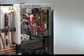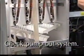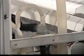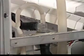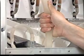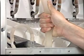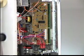Next, let's make sure the ice maker is purging properly by checking the pump-out system. After 5 minutes in the freeze cycle, unplug the float switch to initiate harvest. This will cause the unit to go into a 10-second pump-out that will flush the dirty water and sediment through the check valve and down the drain. You could also squeeze the pump supply hose tight enough to force the water down the drain, emptying the reservoir and allowing the float switch to open by itself. It is important to understand the control components of the KM-Cuber: the control board, the float switch, the thermistor, and bin control.